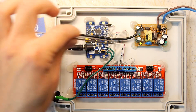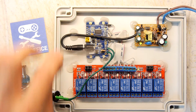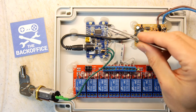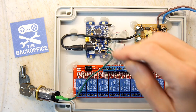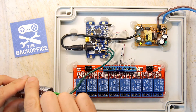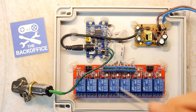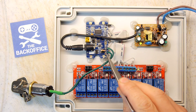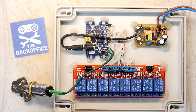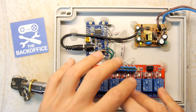This is actually a six volt power supply — a bit hot really for a five volt device — so I've driven that through a diode to drop the voltage down a touch. It'll still be just over five volts, but it's fine and happy enough. The ground is coming off the booby board so it's all referenced to the same electronic ground. I've got a momentary security lock-type switch here, wired to pin one. Pin one is looking for a pull-to-ground to activate the board in the standard firmware. I've got a resistor — about 10k to 20k — just pulling it up to five volts, so it's a simple pull-up.